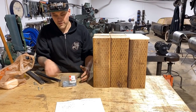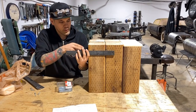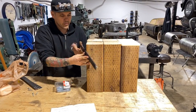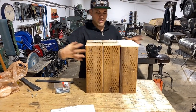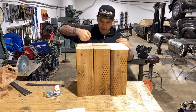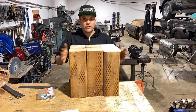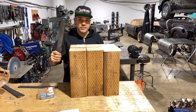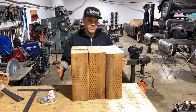So what I'm gonna do is I'm gonna screw it all together and then we're gonna bend these pieces into little L brackets and they're gonna hold on to the corners. So this is gonna be basically here with this tab bent at a 90 degree. It's gonna come around the corner, be bent at another 90 degree. That way we'll be able to put bolts here and here, here and here, and that's essentially just gonna hug it and keep it all together so that as we're pounding steel or aluminum into the bowl here, those forces that are trying to spread it all out and destroy our freshly built shrinking stump will be met with 1/4 inch wide steel that will wrap it and hold it all together. This is all theoretical. I haven't built one of these, but I think this is gonna work out awesome.